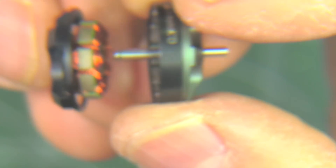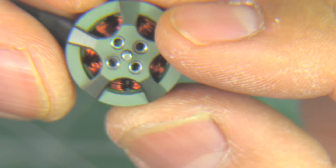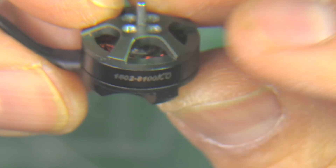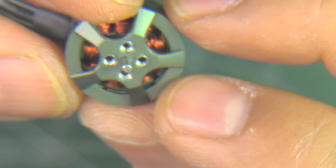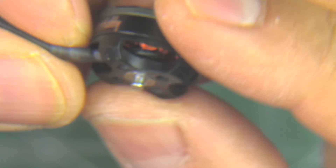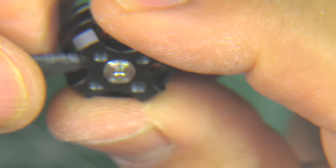That's the teardown of this motor — pretty interesting new size, pretty neat. I'm pretty curious to see how it performs with the usual two and three inch props. I'm going to try 2S and also try 3S on this 8100kV. Hopefully the motor can take it — that wire seems to be pretty sturdy, so it should be able to take the quick stab on the throttle to full throttle. You're going to have to be careful running this high kV on three inch props and 3S.